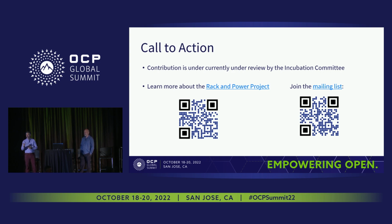Okay, sure. Go ahead. Hi, I'm Rajiv, and I'm from Enersys company. My question is, I'm coming from telecom-based power system designs. The systems we manufacture, like 99.9 systems, are like 23-inch rack space width. Now we are talking about changing the telecom-based central offices into data centers in the future. There's a concept going on called CORD, Central Office Re-architected as a Datacenter. So my question is why you picked 21-inch racks instead of 23-inch racks? Because in the future we can use the same rack in the telecom market and the data center market.